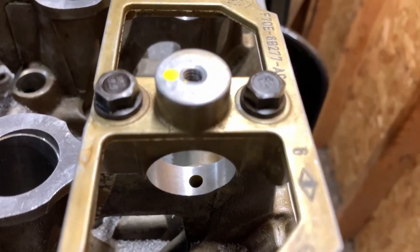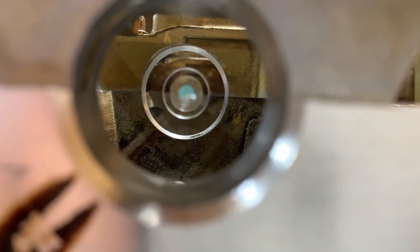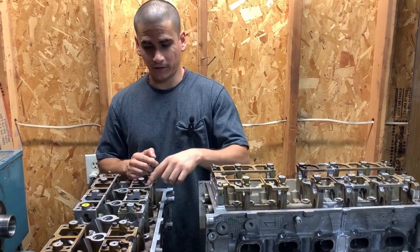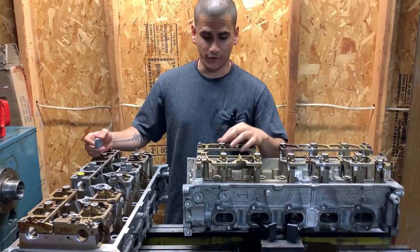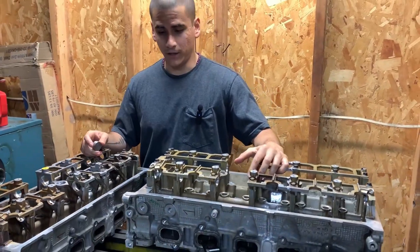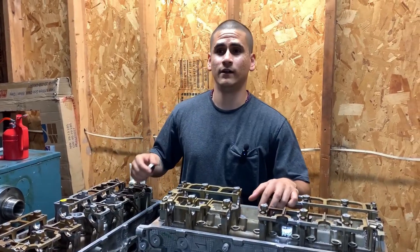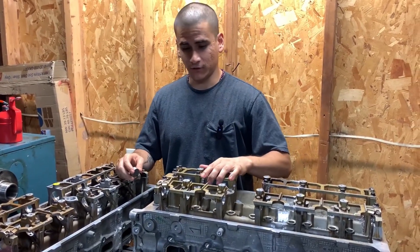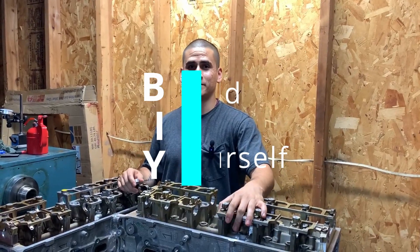We finished both heads - you can see all the bores are done. It went pretty well, everything worked out. We got a lot better on the second head so they're much smoother and it took a lot less time. We ended up returning the bearing kits because the oil holes didn't line up, and we already put in an order for three new kits - hopefully they'll be here in the next couple of weeks. In the meantime, the next step is ordering all the valve train components: springs, seats, followers, whatever we need. We'll also need to call shops for camshafts since there are no four-valve camshafts available - we're going to need custom cores. And finally we have to send these heads to a machine shop to get them decked and cleaned up. If you can't buy it, build it. Thanks for watching and we'll see you guys in the next video.